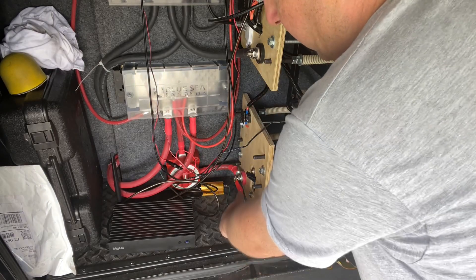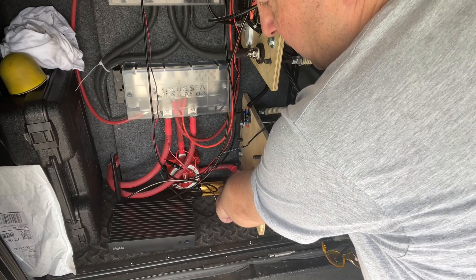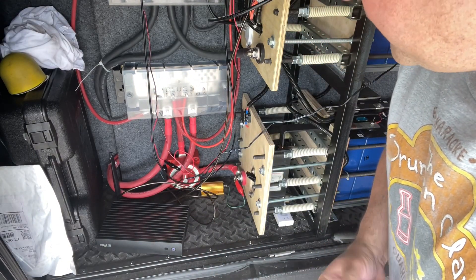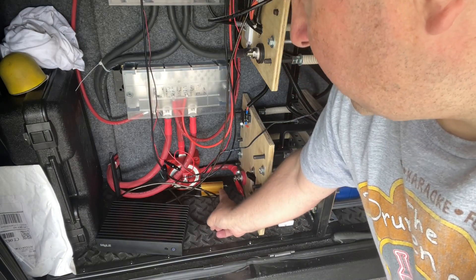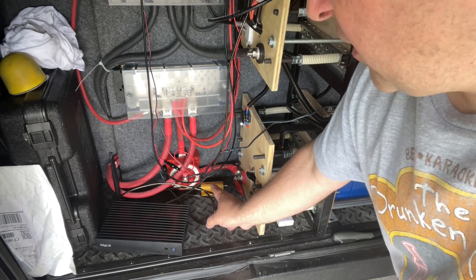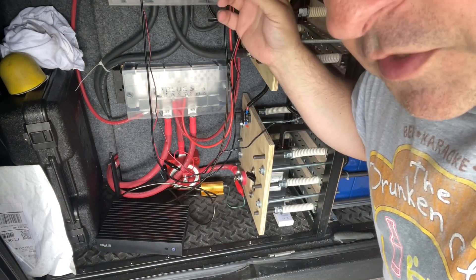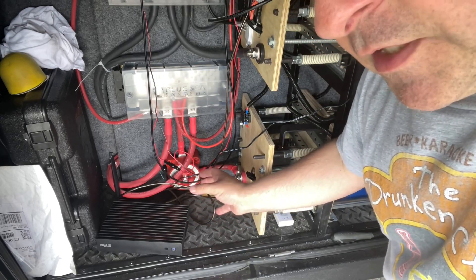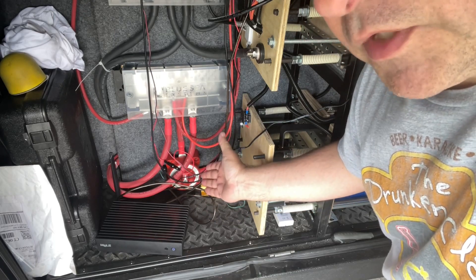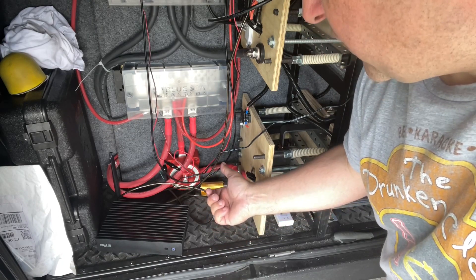As far as the battery is concerned, we've got the battery positive here and the battery negative up here. From the battery positive there's a wire going to a resistor that feeds into a three-position switch. Position one connects the positive bus bar to the battery through that resistor — that's how I do what's called pre-charge. This is really important because I have two large inverters and large solar charge controllers with a lot of capacitance. If I connected directly, I'd have a huge spark and would wear out the contacts quickly.